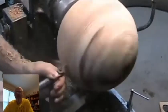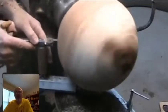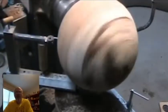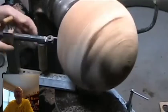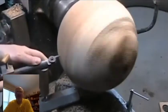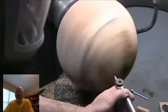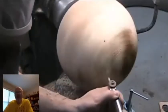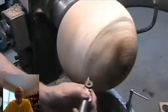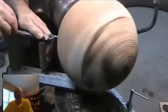A commercial jig would have a very nice threaded tool advancement that allows you to very precisely decide how much to move on each pass. If you're too aggressive on the cut, the quality is not as good. I've experimented with a Hunter carbide cutter at a 30-degree angle — the cut is much cleaner, more like a shearing cut. I do use that in this sphere jig on occasion, but once I get it round like this, I could just switch to conventional tools and clean up the tear out afterwards in just a couple of minutes.